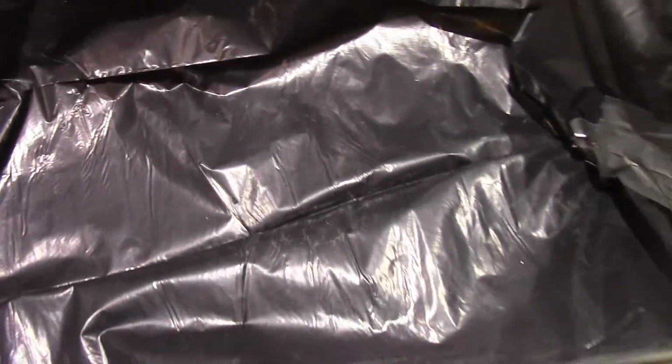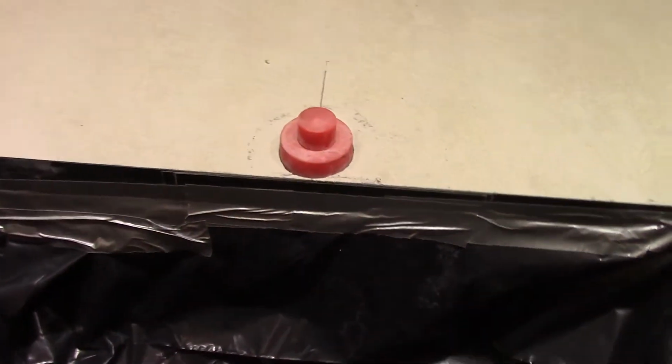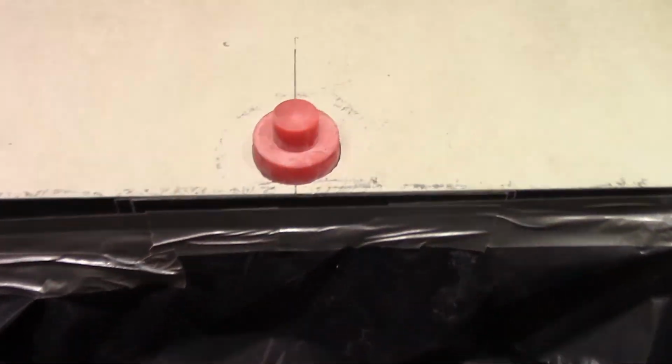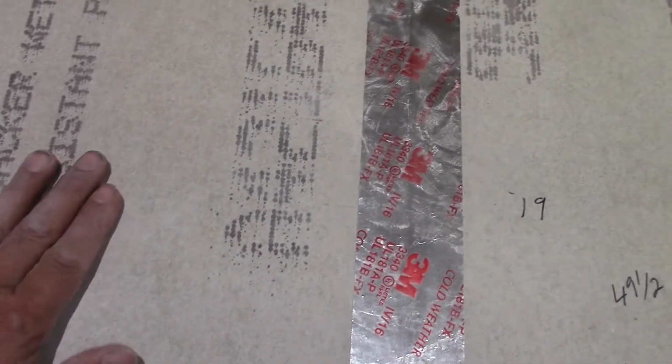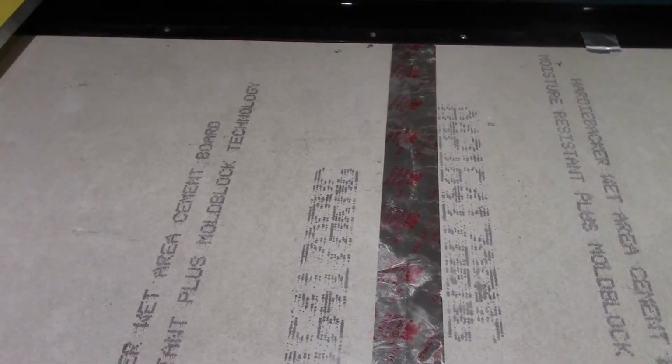And then there's our little hole for the faucet. And now that we're getting ready to start laying our reinforcement in here, we'll want to run a vacuum cleaner over here and clean this all up real nice and wipe out the inside edges of this form, because we don't want any foreign material on there to ruin our outside edge. So moving right along.